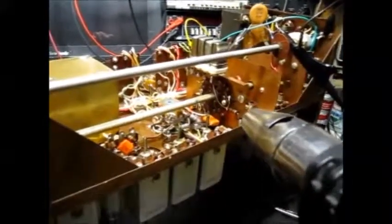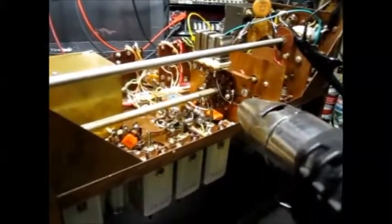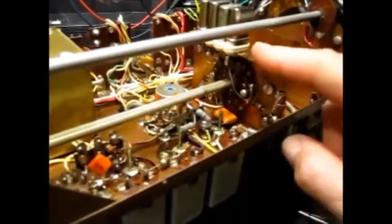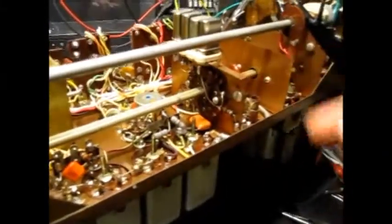This circuit is completely worn out. It needs rebuilding. The switch is just intermittent. Heated up slightly, it'll probably come back on. Heating it very slightly with a heat gun — it's not hot, just warm — is sufficient to dry the wafers out and get oscillation again.